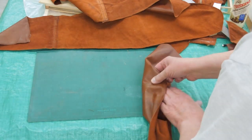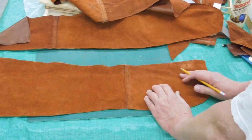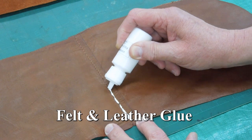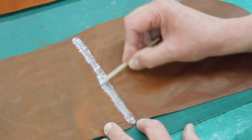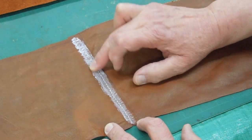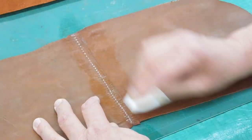This part of the bellows is just going to be bending up and down like this. If I hold this up to the light, I can see the holes from the stitching. So now I'm going to take the leather and felt glue, which remains pliable when it's dry, and I'm going to push it down in alongside of these stitches. I'm going to try this from the shiny side and hopefully I'll be able to clean it up a little better. This is only getting pressurized to 5 inches of water, which is just a little over 0.15 PSI. I think this will be quite sufficient. After that dries, I'll decide if I'm going to do the other side or not.